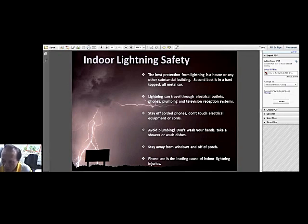Okay? So, John Ducos, sir, will we need wire shielding on the air rods? No need. They would usually be a bare copper wire. The only time that I would suggest an insulated cable is when the grounding conductor is being used in a residential building. Say, for example, you have a condominium.